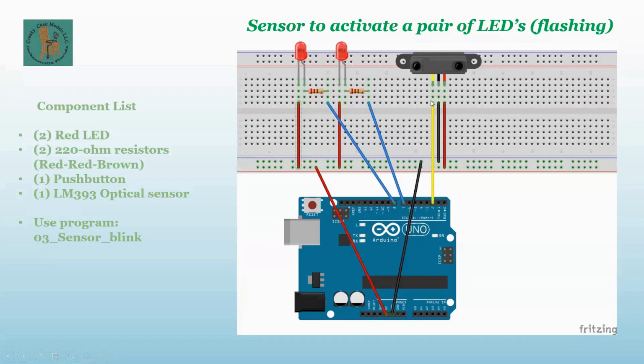If you have the sensor, this is how you're going to hook it up. Go ahead and remove the switch. The only thing you're going to do is the ground is going to go to the ground of the sensor, and the 5 volts is going to go to the 5 volt input of the sensor, and pin 2 ultimately is going to end up on the D output of the sensor. So go ahead and do that. I'll give you guys a few minutes to do it. This one shouldn't take as long because you're really just moving a couple of wires, but I'll give you 3-4 minutes.